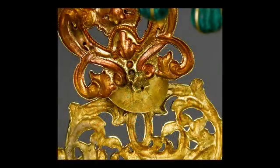My next obstacles were these nuts that attach the arches to the diadem. The nuts had been decoratively filed and were a point of visual interest, so I didn't want to cover over them with a bulky mount. However, they fell really low on the crown, so it was a point in the mount where I needed to maintain rigidity. So I needed to find a way to go around them, but also maintain enough brass for the mount to remain strong.